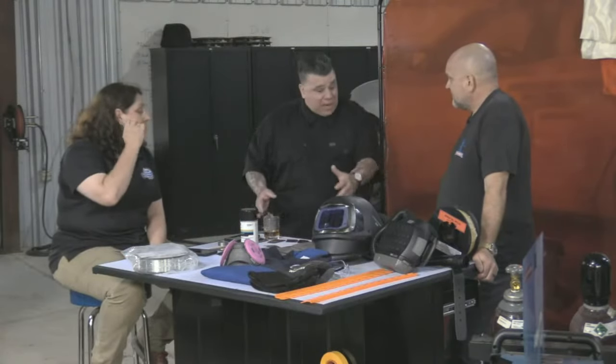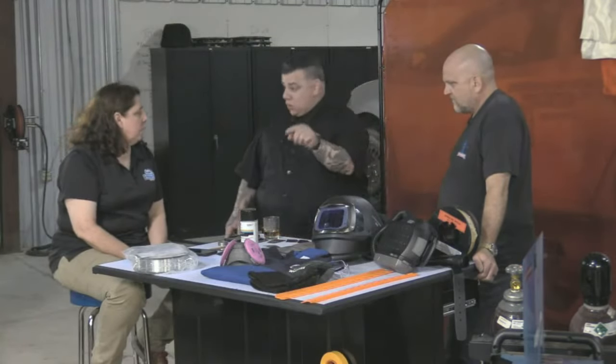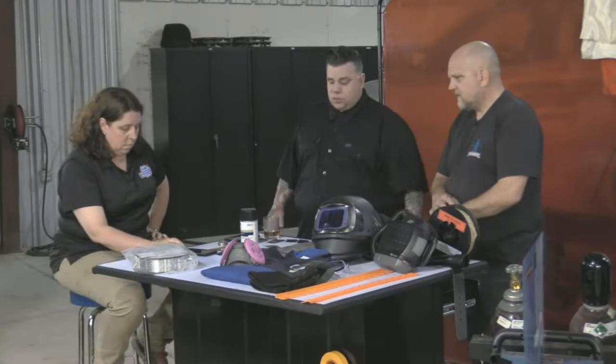What happened was you fried the wires from the resistance welder laying against a car that's next to me. I'm welding on this car, and there's a car here, and I put the welder next to the car, parallel. That's EMI in that car while I'm welding. So this car's protected, but in that car I blew the circuit breakers, I blew the computer components, whatever. That car doesn't start, and we only changed the bumper cover. Why is that car not running? These are the problems we don't really get. It's science, guys, and we don't get the science all the time.